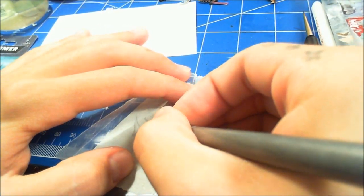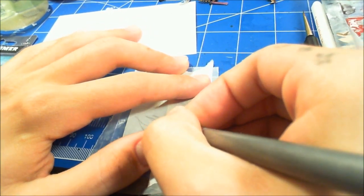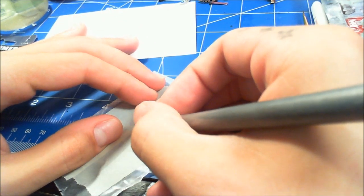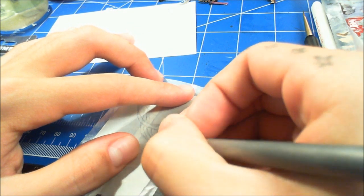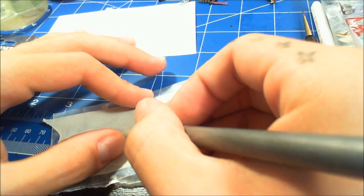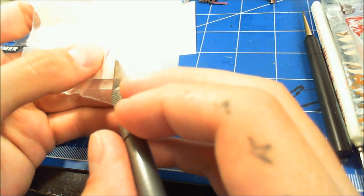So, oh, and also when you're laying your tape down, make sure that you're laying it onto the wax part of the paper. Otherwise, when you try to peel it off, you're going to lose your stickiness. And again, that's why, if you're going to use stuff that you buy at the hardware store, try to get the, I believe it's the Frog kind. It's actual painter's tape. That stuff's really good. If you buy something cheap, it's not going to be very sticky, and it's not going to work very well. So make sure you don't be a cheapskate on your tape.